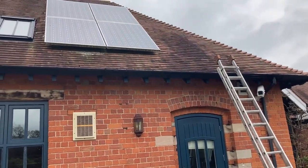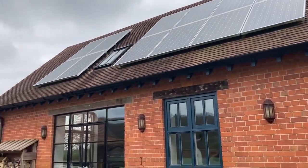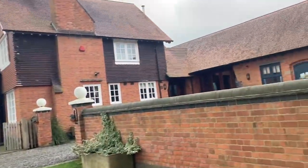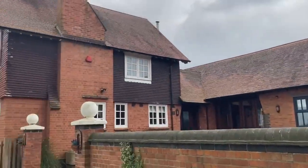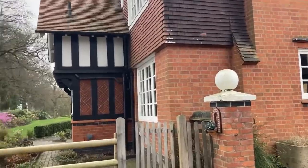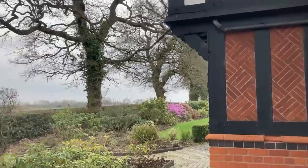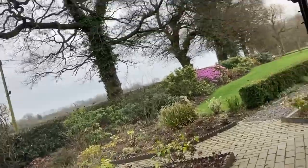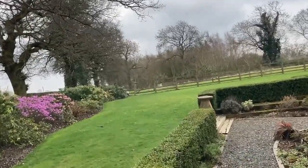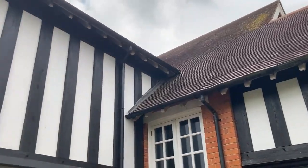Now, there's no point rushing. There's a particularly dark spot here where my ladders are, so I'm going to be test patching around there. I might just do a few little places around the property as well, so the customer can keep an eye on it. Once the biocide starts getting to work, it'll start working instantly, but to start seeing nice results, you're looking at weeks, months. The main objective of doing a test patch is so they can begin to see the results and imagine more of it here, like it goes on forever.